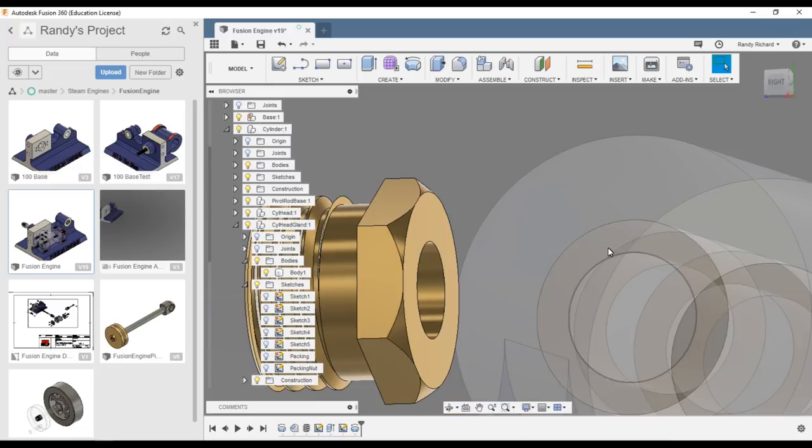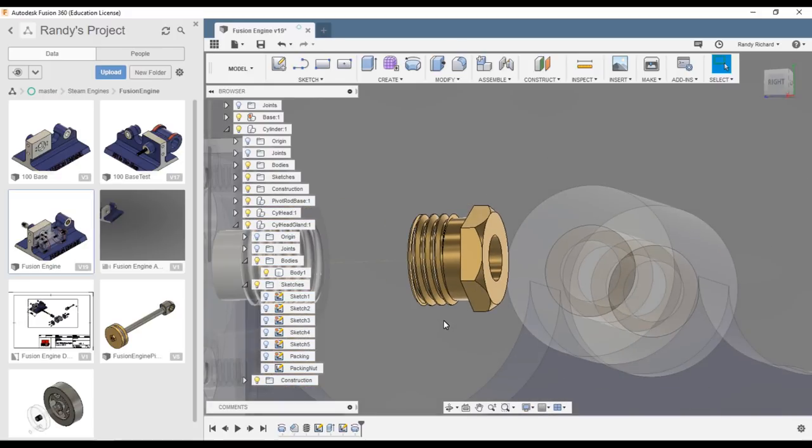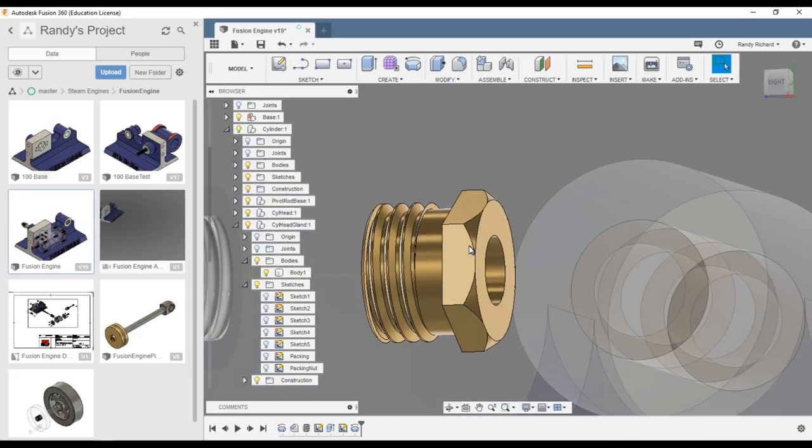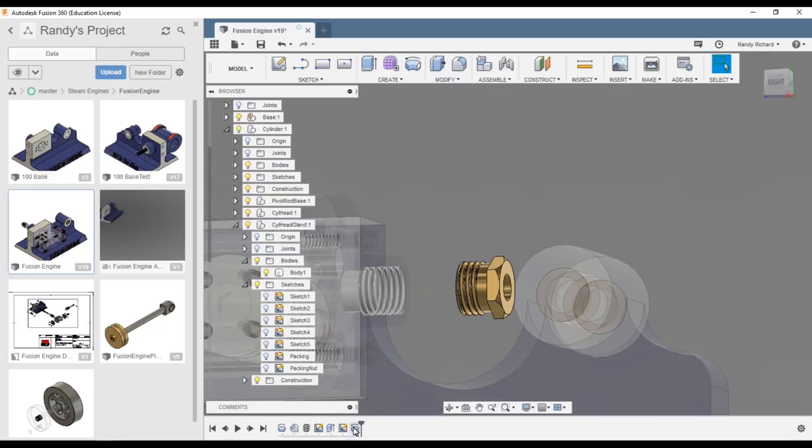Since we drew the triangle on a high corner it'll nip all the corners just fine. Stop sketch, then do a revolve as a cut. You can see how it nips these corners off — say okay. The corners are nipped a little to make it look like you turned it. That's how I do that — I can really control how it looks by adjusting the triangle size.